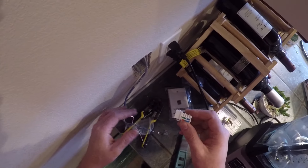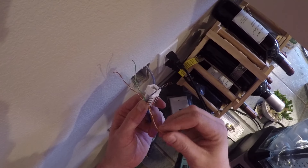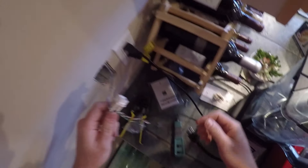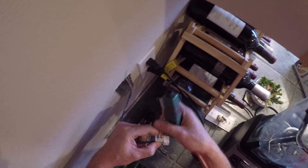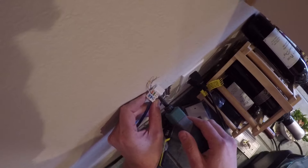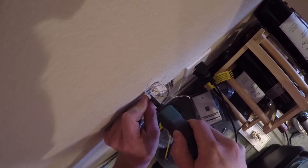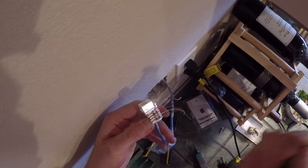So the first one's going to be stripe orange. I line the edge of this connector up right there to the edge and then pull my wires in. Now we do the blue. That's looking pretty good. Once I'm done with one side, I'll go ahead and punch it down. If you have a proper punch tool, there's a cutting edge and a punch edge — it cuts off the excess wires. If you flip it around you cut the inside wires and have to start all over. The trouble with doing these on the wall is finding a nice flat surface. You can press it up against the drywall, but just know it has a percussion-style impact, and you want to make sure you don't damage the drywall. We've got stripe to stripe, solid to solid, stripe to stripe, solid to solid — and we're in B. We're good to go.